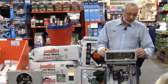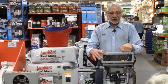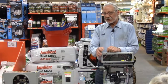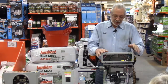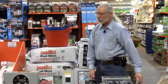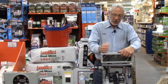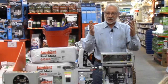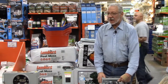The reason they do this is because now I can take that template that I've made from my old panel, put it onto a solid piece of metal without any punch outs on it, map what I have now, and then proceed to cut those holes out to match the pipes coming into my old panel. That way it just fits in nicely. If you're trying to jiggle pipes to fit this pattern, you probably won't be able to. You probably don't have enough room to wiggle the old pipes to fit the new pattern. So a lot of times it's easier to use a wiring trough like this, cut all my old holes from the top of the panel, put this in first, and then from there we can use, again, the new pattern on the new panel.